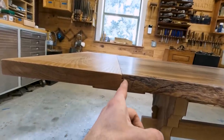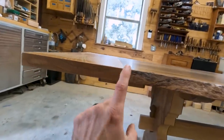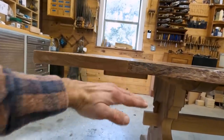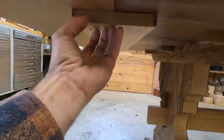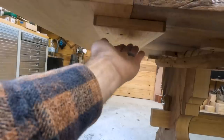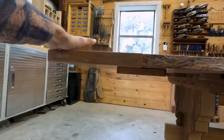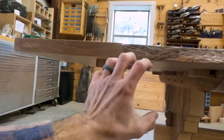Here you've got both a mechanical joint with screws and a glue joint. Makes it much stronger. And to make it even stronger, we added this piece underneath here to help keep it level. With the dovetail alone, it really wants to sag like this. This piece helps keep it level with the table and guides it on a little bit easier. This piece is a veneered piece of plywood, so that gives it even more strength. If we used just a board alone with the grain running this way, I think there's a chance that board could split if you put a lot of weight on it. It's probably unlikely, but just to play it safe, we used this plywood with veneer.